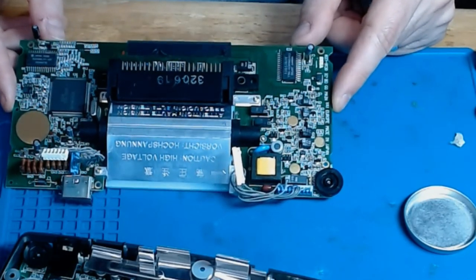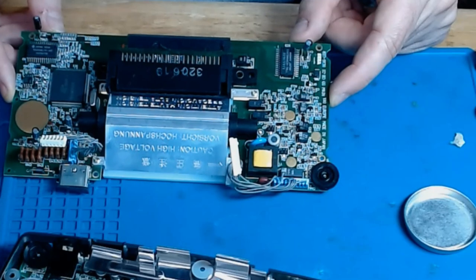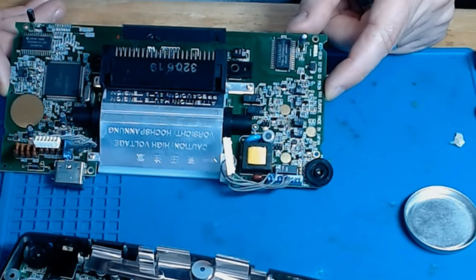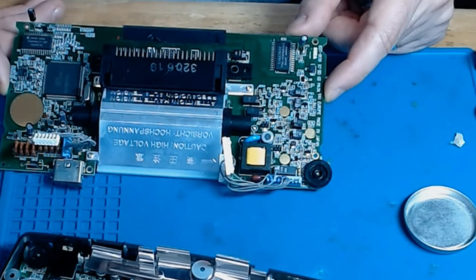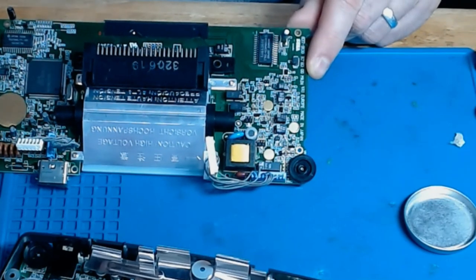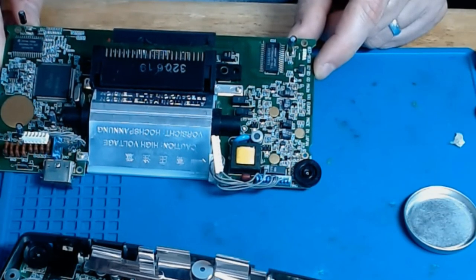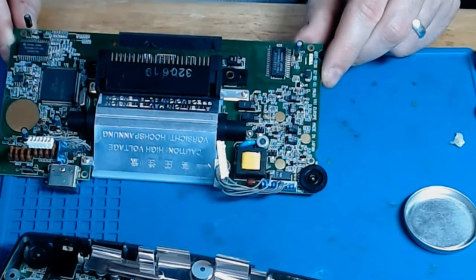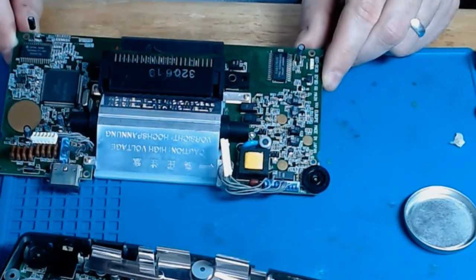The first four are done - not the best solder job but I haven't soldered for a while. For the first leg, move the other one out of the way, heat the solder on the pad until it's liquid, then drop the first leg in and let it dry. For the second leg, rest it on top of the solder on the pad, press it down lightly, and also press the top of the capacitor down. If you make a mistake, clean the tip, clean the pad, and start again.